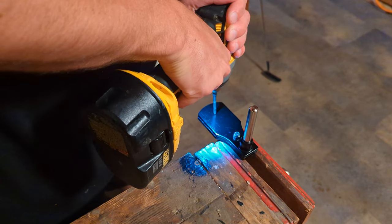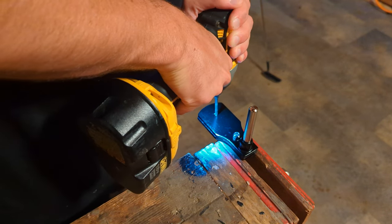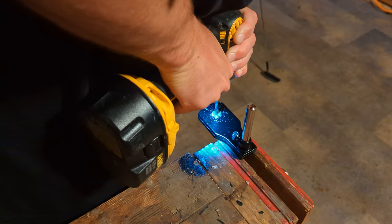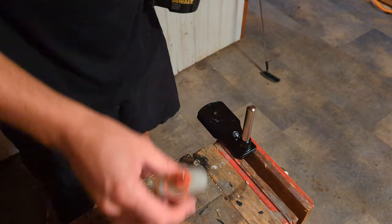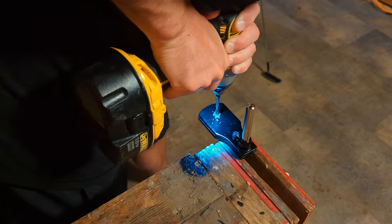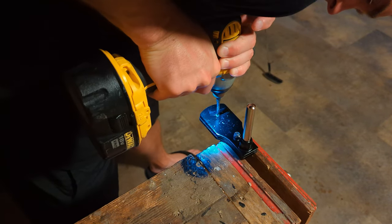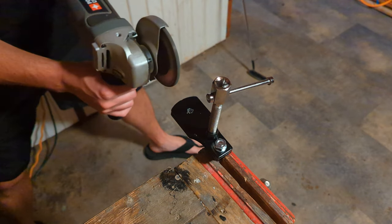Here I'm starting off by putting it in the vise and I'm going to drill a hole. The hole needs to go through both of the jaws. What I actually want to manufacture is a U-shaped channel, and I'm going to do that by drilling out two holes. Use a nice sharp drill bit, a little bit of oil, and give it time and pressure. The metal was nice and solid so it took me a little bit of drilling.